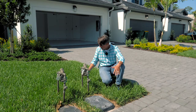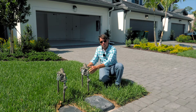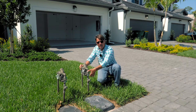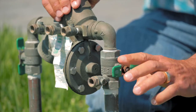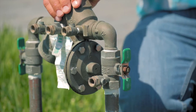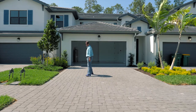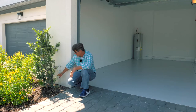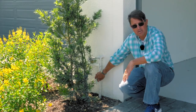If there is a leak from here to your home, you will want to shut the water off. You have two water shutoffs. You do not have to shut off both — shutting off one will be sufficient. You simply turn the handle here to shut it off, turning it this way to turn it back on. In addition to the water shutoffs at the backflow preventer, there is also a shutoff at your home. This will shut off the water to your home as well, and if you have a leak inside the home, you can shut the water off here.